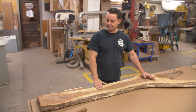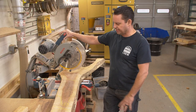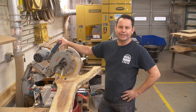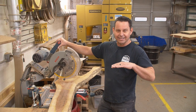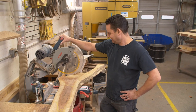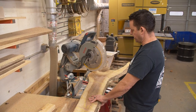The next step will be to cut these and plane them down until they're nice and flat. When you're cutting something like this that's not flat up against the rail, it's likely to kick, so you need to take it slow, drop your blade down nice and slow, real even, and most importantly, keep your hands and fingers away. We're going to try and cut this big piece off first just to get it out of the way.